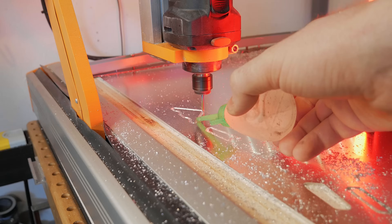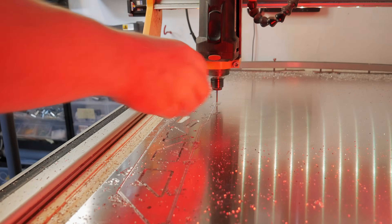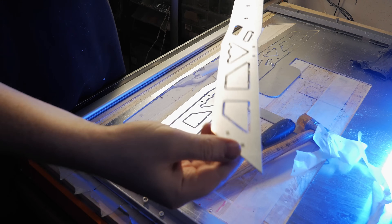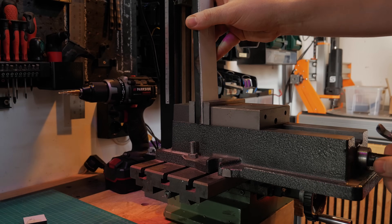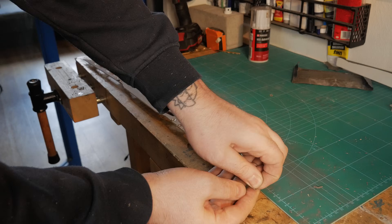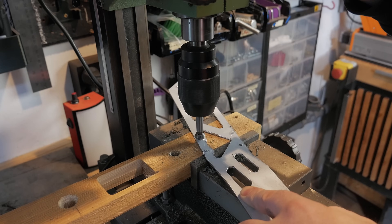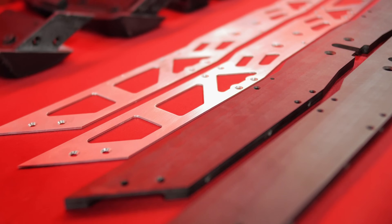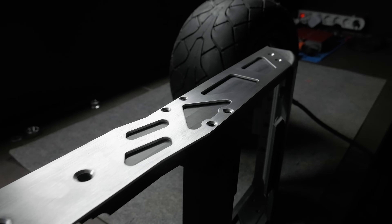To at least improve things for the prototype, I decided to go with a sandwich structure — HPL on the inside, reinforced with an aluminium plate on the outside. Hopefully that makes it strong enough. I glued a piece of HPL to some aluminium and started hammering. It took around 20 solid hits to break, and only because the glue gave up first. Not bad for a paper board! I removed the protective film from the aluminium plates on purpose to embrace that brushed look from the start. Even though this is still a prototype, I'm already really pleased with the aesthetics — it might have started as a functional solution, but visually it's definitely a win.